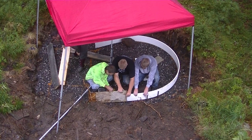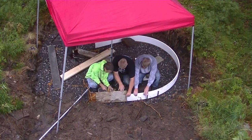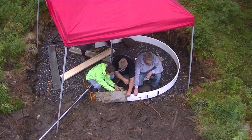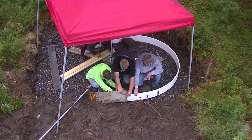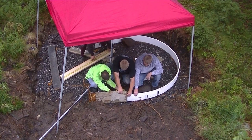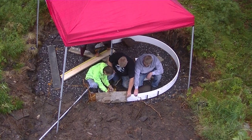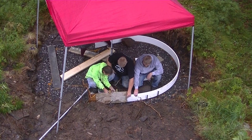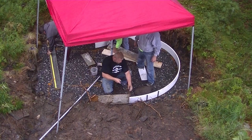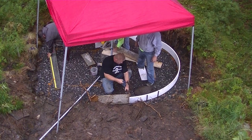You're going to want to stay tuned for that, but part one is just getting the forms right. The 16-foot piece of Azek wasn't quite long enough to do the whole circular part — we needed about another foot — so we're adding a piece of quarter-inch plywood to it, and then we can fasten it to the three-sided rectangle piece we're putting together.